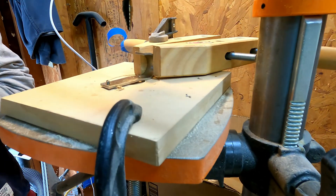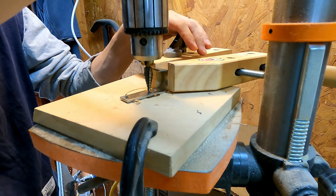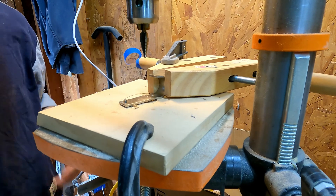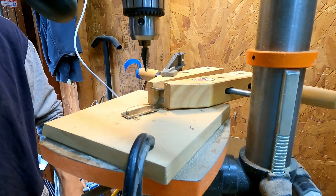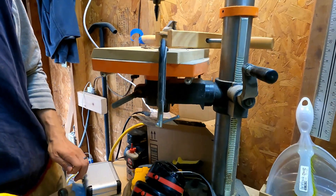It serves as a registration point. Put that piece in there, align this, make sure our hole is in the right spot — close enough. On the first one we made a preliminary drill, and then this one we'll switch it out and come back with the larger bit to make sure we don't put too much strain on the bits.